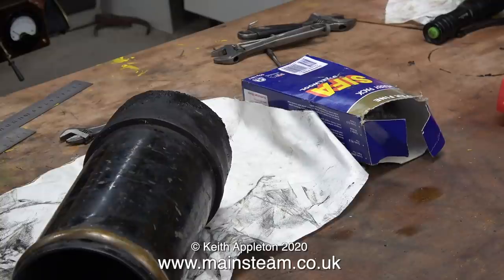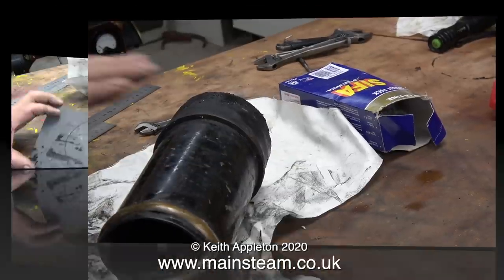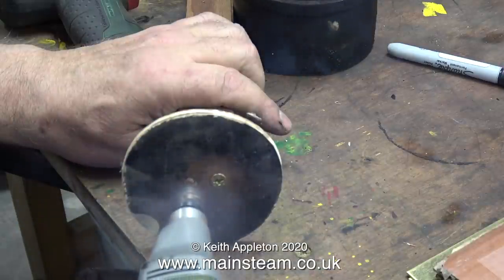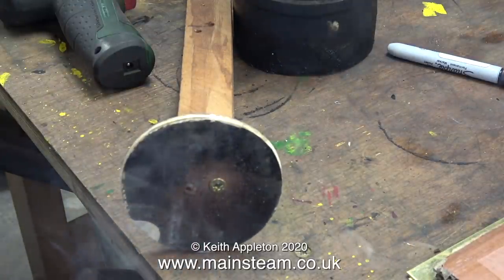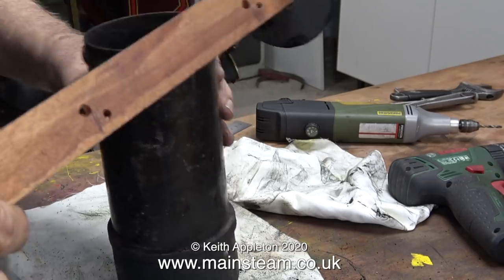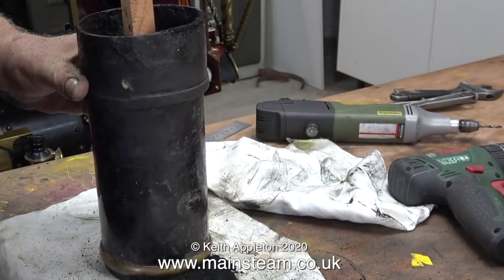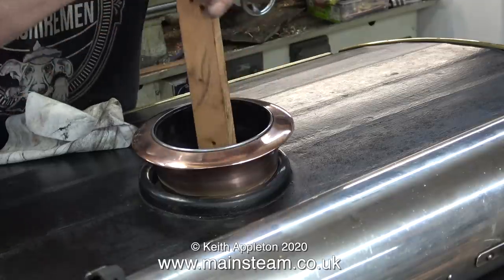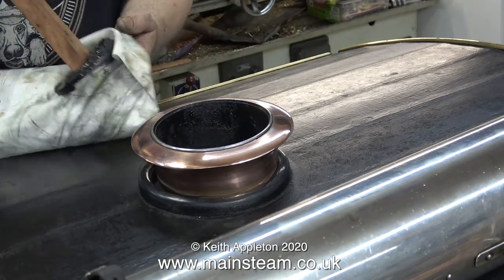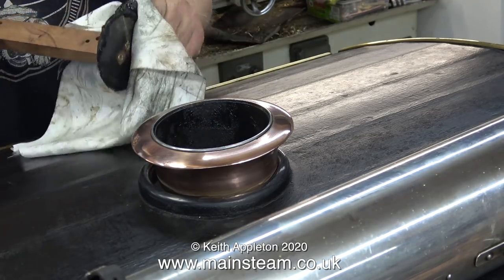This part on the bench is the chimney extension — it's a push fit in the top of the chimney and allows the smoke and steam to be just above the head of the driver when the engine is driven on the road. The inside of this extension tube and the chimney itself are covered in a thick coat of steam oil and soot, so I'm knocking up something to scrape it off. I drew around the bottom of the chimney extension but cut very much on the inside of the line — I don't want this piece of wood to be a tight fit. I just move it up and down and at every pass it's scraping soot and steam oil off the inside of the tube. You could make one of these for any size of locomotive.